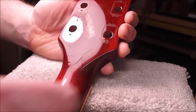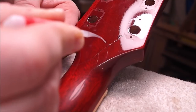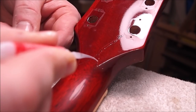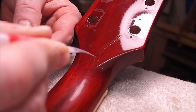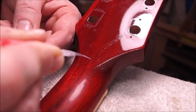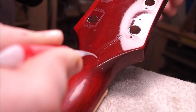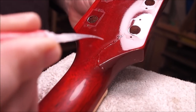The question arises whether I should do these super glue crack fills before or after I've cut the channels for the splines and installed them. I've done them both ways. At this point, I think I like to do the fills first because it consolidates the edges of the cracks a little bit more - there's always the chance that they could be hit by the router bit and want to fracture off. The other thing it does is add a layer, and eventually I'm going to want to level sand all of this area, so this kind of helps level things out. It gives me material to level through.